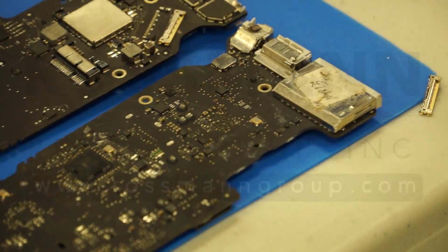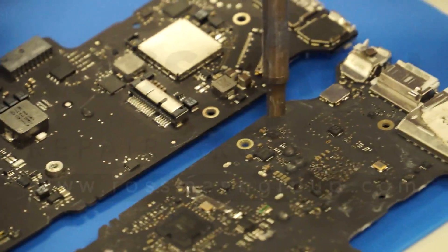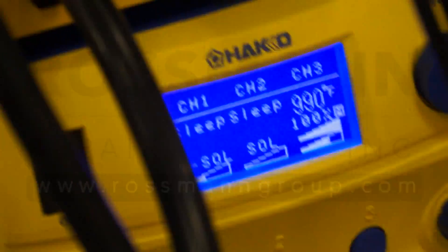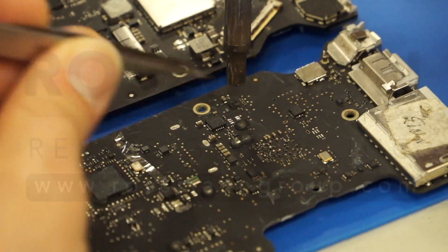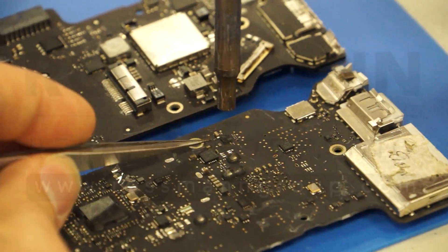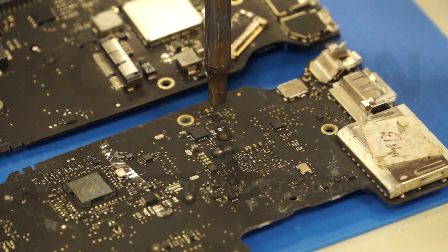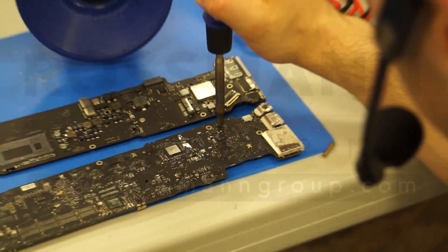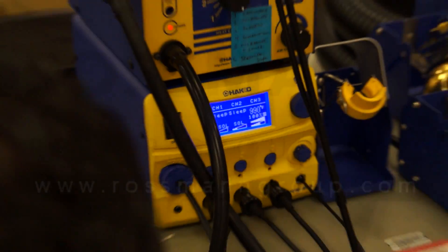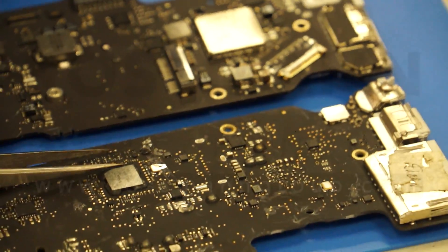Removing the LED driver chip — that's actually difficult. It's very easy to mess up soldering this. So this thing claims it's at 990 Fahrenheit. This is not a big honking connector — this is a very tiny IC. Not even remotely close to coming off. I could probably encase the damn thing in the nozzle and it's not going to come off. We finally got it — it keeps cooling down as I go to pick it up. That's how long it took. Now let's try the Hakko FR801.